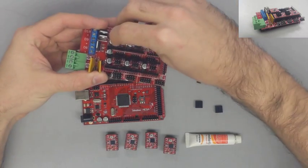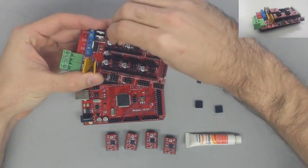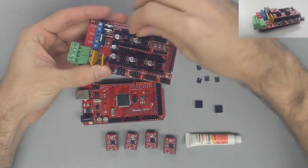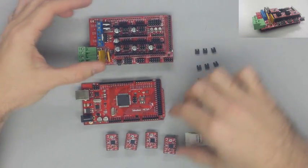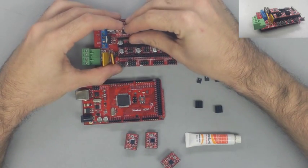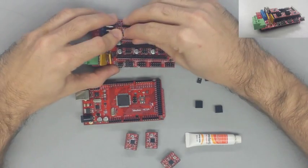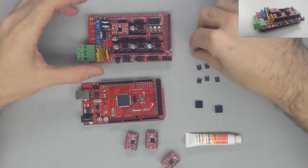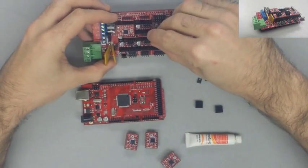Now in the video, you're going to see me putting three jumpers per stepstick, and there are two pins for each jumper, and you'll have a spot to put those, right underneath where the stepstick drivers are going to go. And make sure when you put the stepstick onto the board that the little silver circle at the top, that's our pot for calibration, is pointing opposite of where the blue and green screw terminals are. It needs to be like that for all of them.